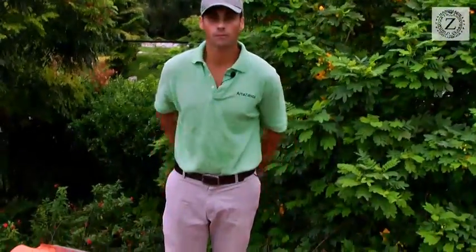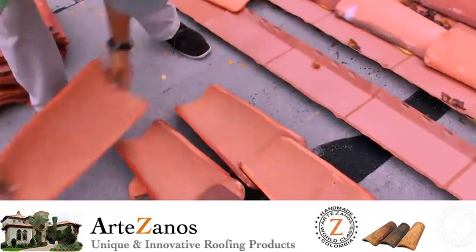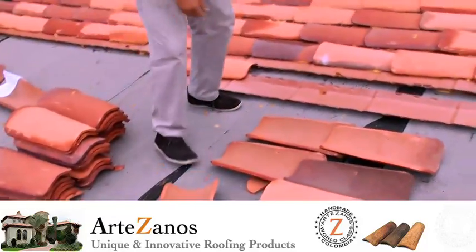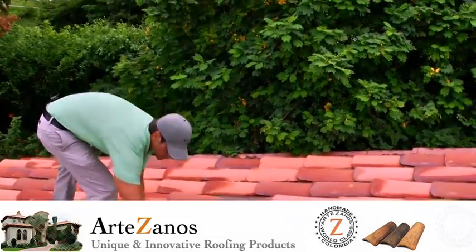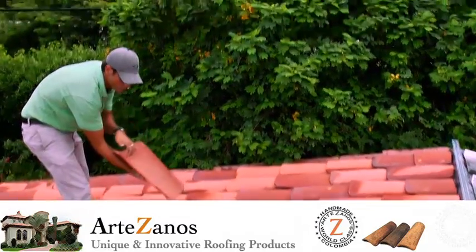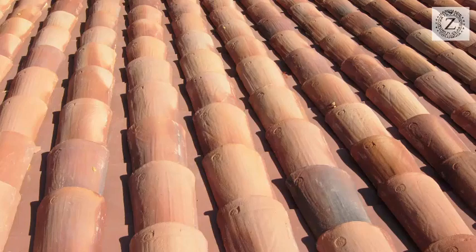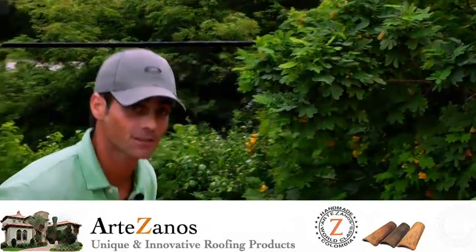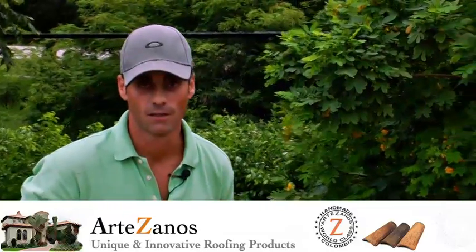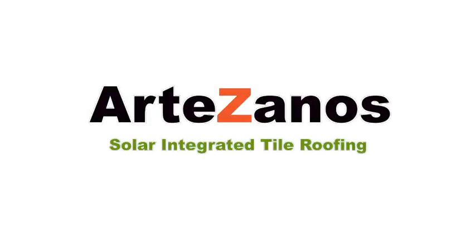Now, if I break a tile — if this bottom tile gets cracked — before, I'd have to pull away tiles, wedge this tile out, put a new one back in. I don't have to do that anymore. I come over here, pull out the broken tile, replace it with a new tile, a little bit of foam, lay it down, let it cure, walk away. There's your roof system. 60 percent less weight — for California residents this is fantastic for earthquakes and logistics. This has a Class A fire rating. This is probably one of the best roofing integrations you're going to see in a very long time, because anyone in the roofing industry knows we've been in the dark ages for a very long time.